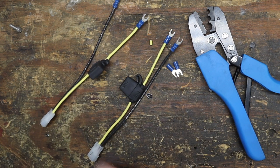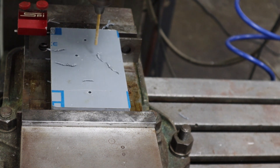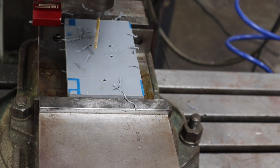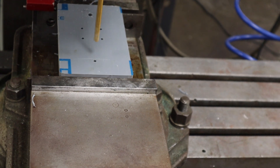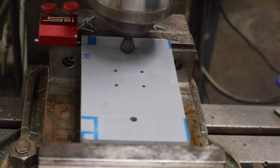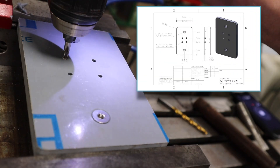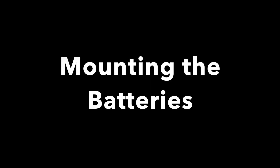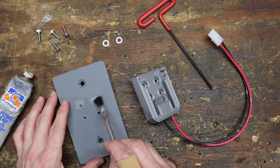Because the plastic wall of the battery compartment is a bit thin, I made a few mounting plates from scrap 3/8-inch C PVC sheet stock. Each plate has four 10-24 tapped holes for the battery clips and two countersunk holes for quarter-20 flat-head bolts to mount the plates inside the compartment. You can skip this and mount the clips directly to the vehicle, but the mounting holes on the clips are grouped closely together. If you'd like to copy these plates, I'll put a link in the description to a PDF of the SolidWorks drawing. A dab of dielectric grease holds the shim washers in place while mounting.